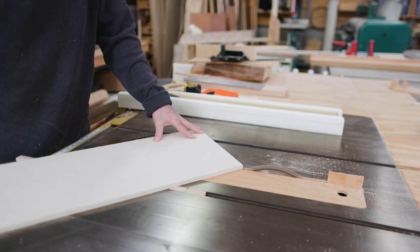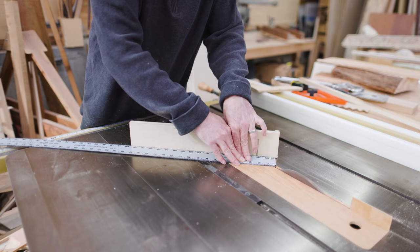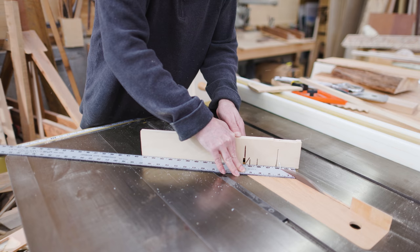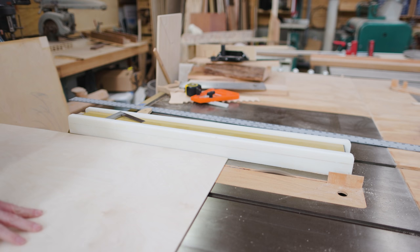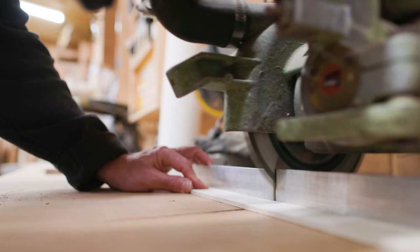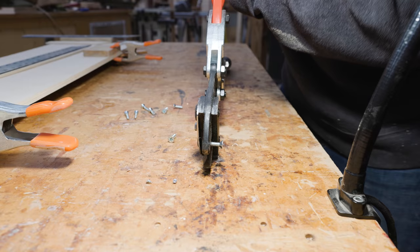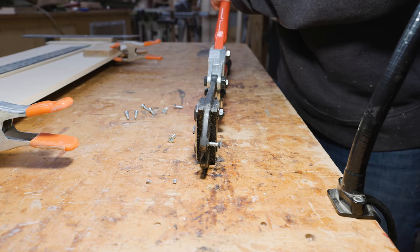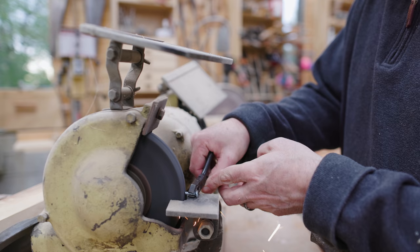The angle should be close to 45 degrees but doesn't have to be exactly 45 from the blade. I cut the plywood to the right length and want to attach a ruler — basically a straight edge — to the top. The ruler will be shaped into an L with a long side and a short side, and I need a spacer to go under the ruler to hold it up from the plywood just slightly. I found a strip of birch plywood that will work for that. The screws I had were just slightly too long, so I cut them a little shorter.